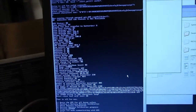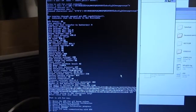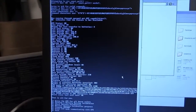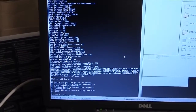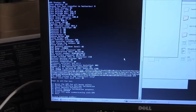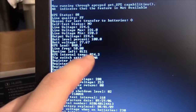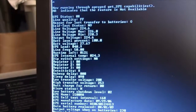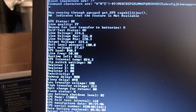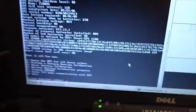85 minutes — well, that's kind of reasonable. I thought it calibrated itself down to almost no runtime at all. Anyway, I'm going to go into the configuration mode and raise the battery constant to make it think it's going to run for ages, and then run a battery calibration to get it down to a realistic level. I set it to think it's going to run for 2 hours with a 500W load — that's about 1 kWh out of our batteries, so there's no way we're going to get that. You'd have to have even two new cheap car batteries. Anyway, let's get going.